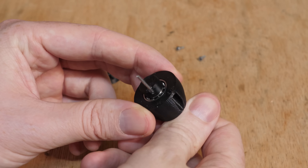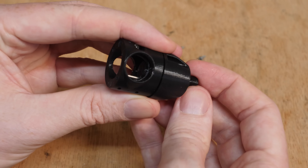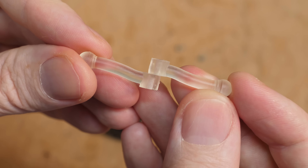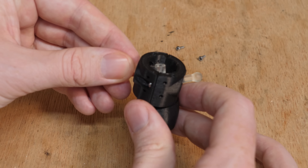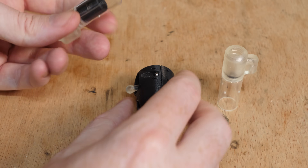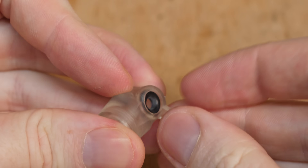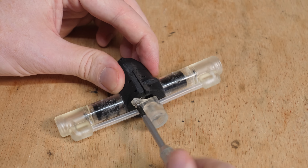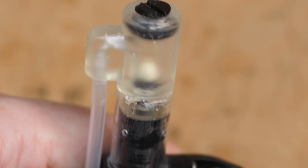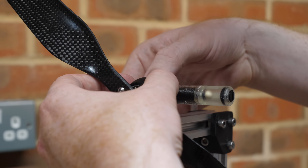What happens if we make a two-cylinder version? The easiest way is to mount two engines back to back sharing the same crankshaft. I printed curved connecting rods that attach to the same rod in the center yet still align with the pistons, fitting into the crankcase in opposed directions. The cylinders and pistons are the same as the single cylinder version, apart from the cylinder heads, which are plumbed together using an air manifold that splits incoming air into two channels through thin white tubes to each cylinder. Ball valves are inserted into each cylinder head with a 3D-printed screw cap — though the air manifold leaked a lot through the o-rings due to a slightly loose design.